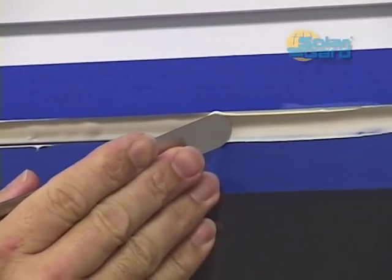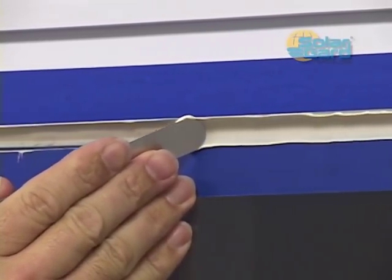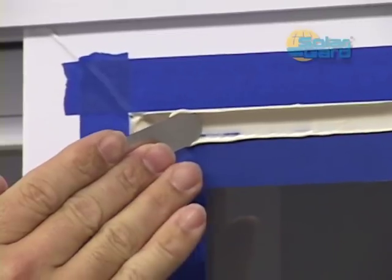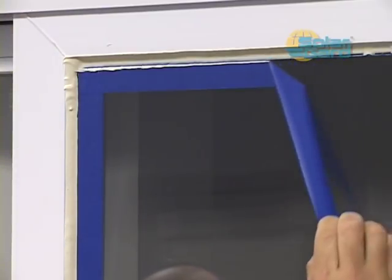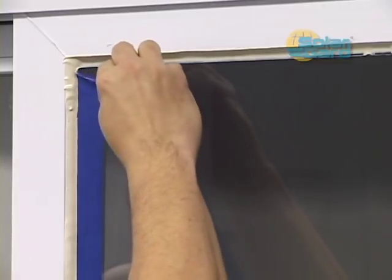You may tool the material as needed. Start by forming a 45-degree angle and always keep your tool close to the sealant to avoid stringing the material. When you have completed the process, remove the guide tape. Peel the tape back at a narrow angle to the sealant to avoid stringing. Clean excess sealant with a plastic razor blade or general purpose cleaner.